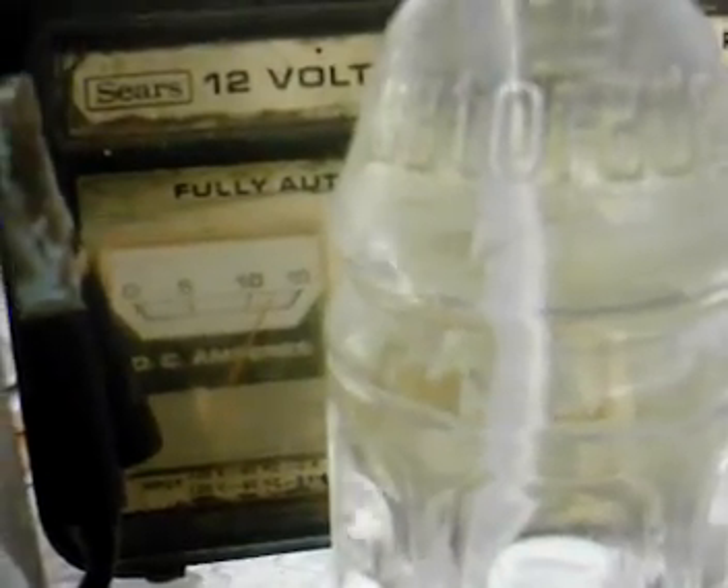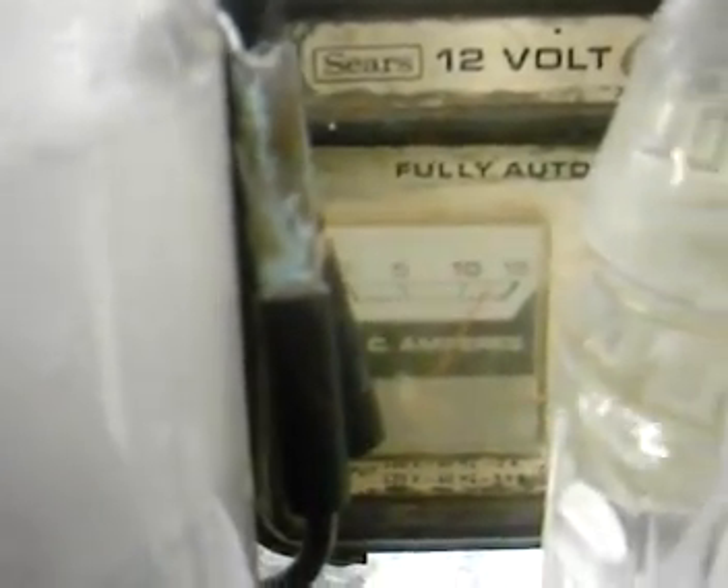Well, I've rebuilt it and put the fifth element in there. I did things a little differently with my electrolyte this time. I used distilled water and baking soda — four and a half teaspoons of baking soda and two hundred milliliters of water. I put it in a blender and blended it up real well, then heated it up to just below boiling to make sure everything was completely dissolved.